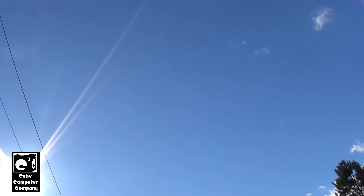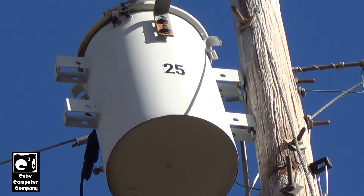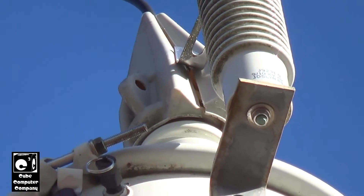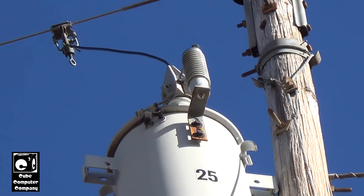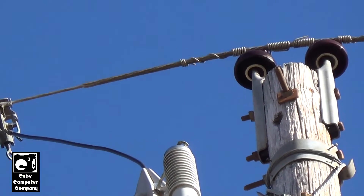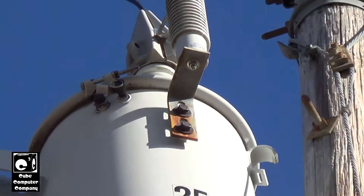On the back side, a regular transformer that has just one set of mounting posts for the pole will generally have the secondary tabs on the opposite side. Up there is the high-voltage bushing, and on top of that is a bushing protector. It protects the bushing from animals like squirrels and birds that could make contact with the high voltage, helping prevent nuisance outages and animal injury. And right up there is a lightning arrester, which acts like a surge protector for the transformer. In the case of a lightning strike on the primary, that high voltage needs to go to ground instead of through the equipment, so it would go through this arrester. You can see the arrester is attached to the transformer can.